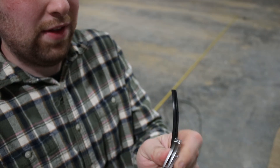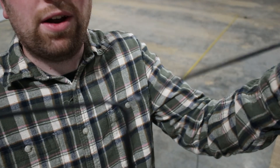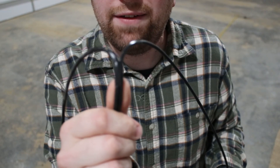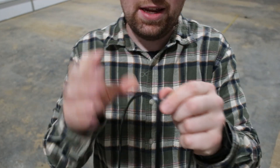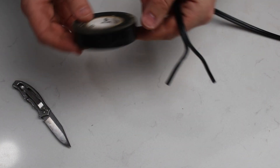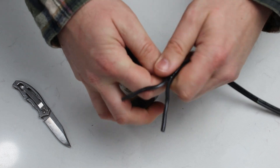At this point I'm going to cut the end off, split it, and stop at the 16-foot 4-inch mark — that will be the V part of the antenna. I cut and splice this section right here, then pull the wire apart until I hit that black tape marking the 16-foot 4-inch point. One lead is the ground and one is the hot — the transmit side. I add just a little bit of tape where the split starts to keep it from splitting any further than needed, so it holds together like ladder wire.